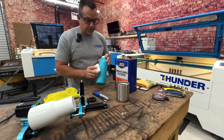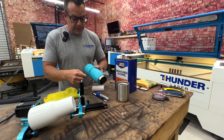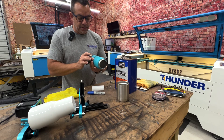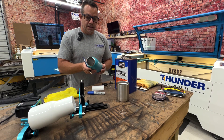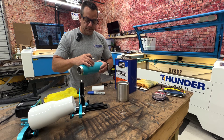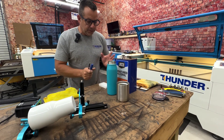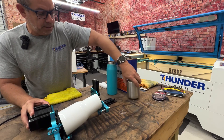I use a tailor's tape to help mark my zero point and then my halfway-around point at 180 degrees — very easy to do with a magic marker or pencil. If doing a logo, I can have the logo on one side and the name on the other. Personally I like to do them in two different shots: I don't set up my graphic to go all the way around, since that much spinning could slip. I do my three to four inch logo for all cups, then come back and do names.